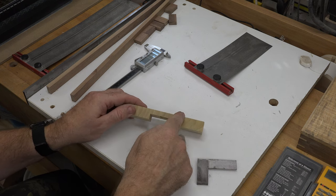So we now need to sand this, guys, and I've said it many times before, nothing is better than a piece of sandpaper glued to a 3/4 inch thick piece of MDF. And that will give this a really nice clean sanding, but it will also keep our nice crisp lines that we want. So now that we have that done, we want to take two of our spacer pieces and we're going to move on to our rear springs that we need two of.